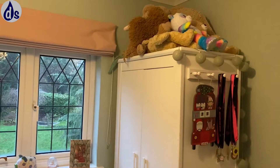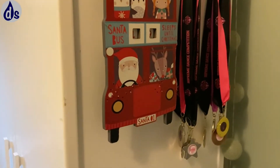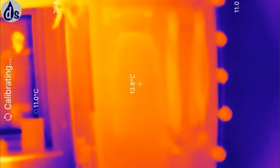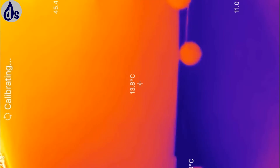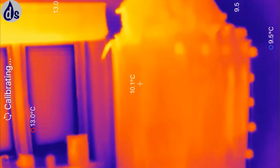But by and large, it's not being caused by the outside but inside. For each room we're going to look at the dampness, mold, and also the thermal image. In these thermal images, red is warm and purple is cold. You can see where the cold patches are on the wall — the heat loss is mainly in the corner. We're talking about mold and the potential for allergies, and you clearly have a lot of mold behind here, going all the way up behind the cupboard.